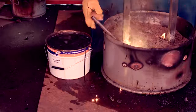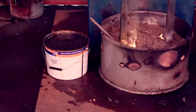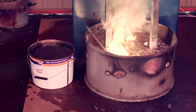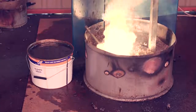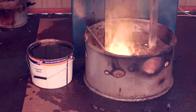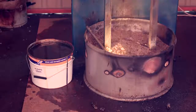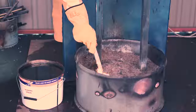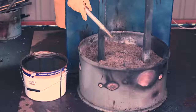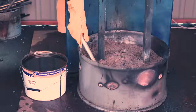Once you have done cutting and FIREPEN is still burning, place it in the box filled with sand, which you should have prepared prior to cutting. Do not ever try to extinguish FIREPEN by waving it around, or blowing on it, or covering it with your hand, or hitting any objects with it. It will drop residue that will burn through everything.